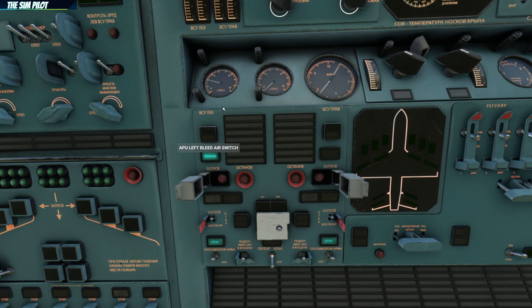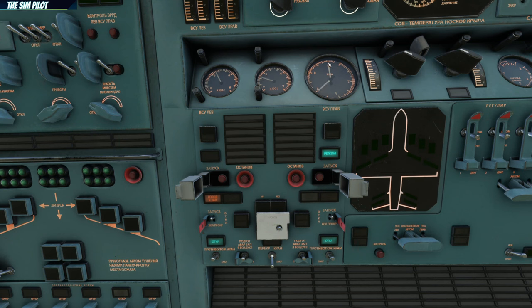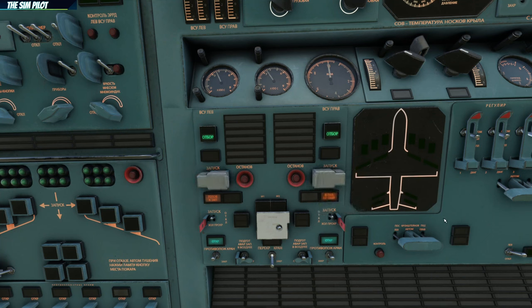When the APU is started we turn the bleed air on. These are the bleed air switches for the two APUs — currently off. These are the APU fuel heaters, also set to off. If there are lights it means they are on; no lights means off. We don't need fuel heating because it's warm enough outside. APU number 1 is online, RPM is at 100% and this is the EGT — exhaust gas temperature of the APU. We turn the bleed air on. APU 2 is almost there; we wait, monitor the startup, put the right bleed air switch to on, and close the starter guards. Now we have APU power.